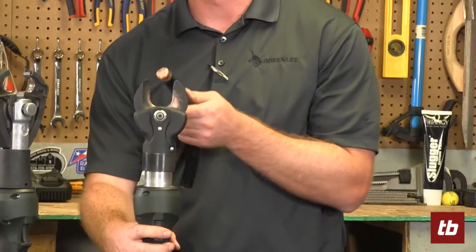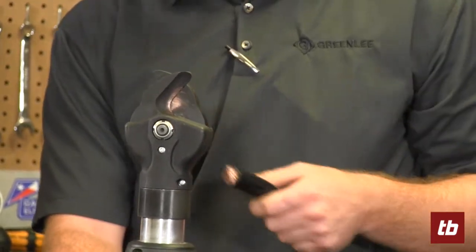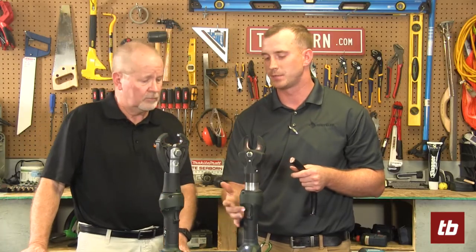So tell me about these useful electrical applications. So this is our battery-powered cable cutter. The range here is from 8 to 1000, so pretty much covers any electrical application that's going to be used by larger contractors. The jaws kind of open and close on their own. The nice thing about these: once you cycle the tool, if you're working with a smaller wire, you can actually stop the blades and keep that position so you don't have to wait for them to open back up and cycle back through. It'll release on its own even if you have your hand on the trigger, and then tapping that trigger again will keep those blades a little bit more closed. Nice little feature so you don't have to wait for the whole cycle once again.